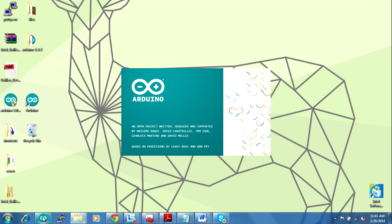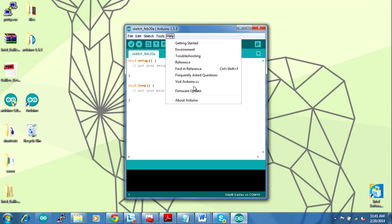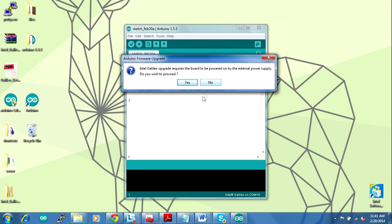As soon as you install your drivers, the next thing you want to do is download the latest version of your firmware. To do that, start your IDE, find Help on the menu, go down to the bottom, and you'll find Firmware Update. This is really important because we often add extra functionalities, including support for Linux and many other things, so you definitely want the latest version. Click Firmware Update and say Yes to proceed. Once you click OK, make sure not to unplug your board — it can take up to five minutes to update. At the end, you'll see a confirmation that it's finished updating.